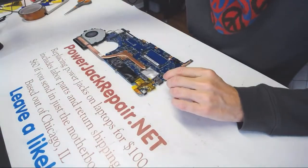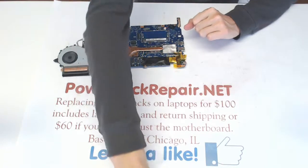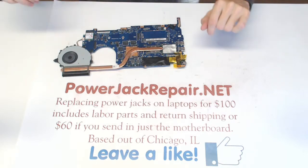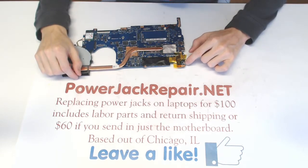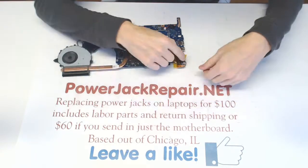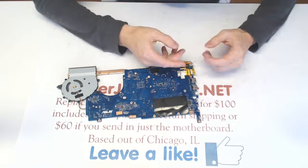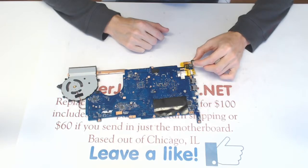What we're gonna do is desolder this old connector, then solder a new connector in there. First, we have to add a little bit more solder to the old connection points. We need to add new solder to the old solder so it's gonna mix — the old solder mixes with the new solder — and it's gonna be much easier to remove the jack from the motherboard. Then we're gonna remove all the remaining solder from the motherboard using solder wick, and clean the holes so the holes will be nice and empty. Then we put this jack right inside the motherboard and solder everything up.